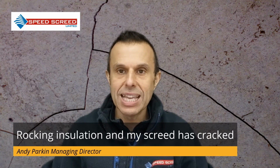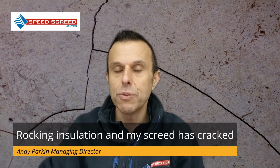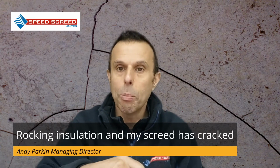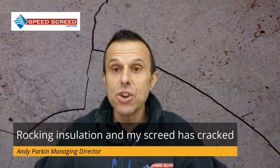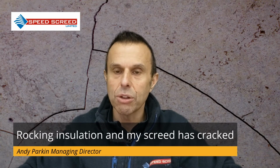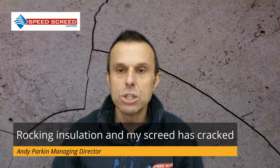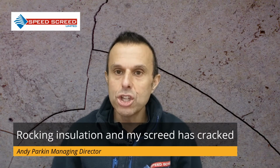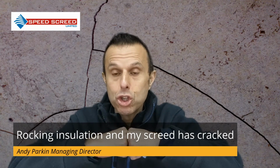If you've identified anything, the thing is to take it out. If you've got a raised area in the concrete, you may have to grind it, or possibly use a repair mortar, just to make it a flat surface that will accommodate the insulation. Certainly rocking is going to lead to instability and potential failures, and you've experienced exactly that.